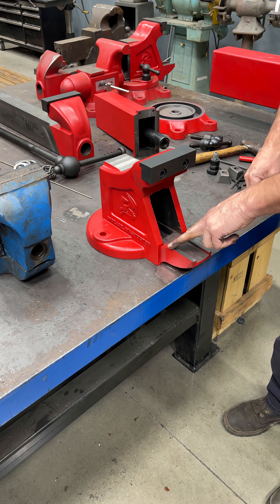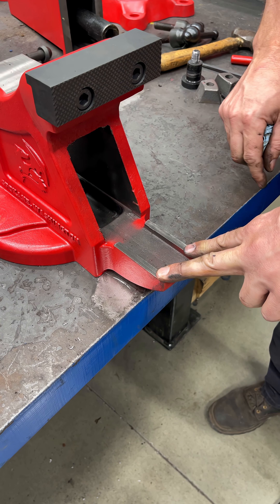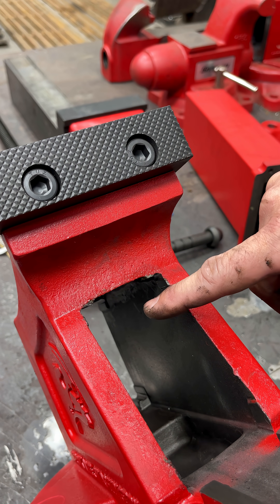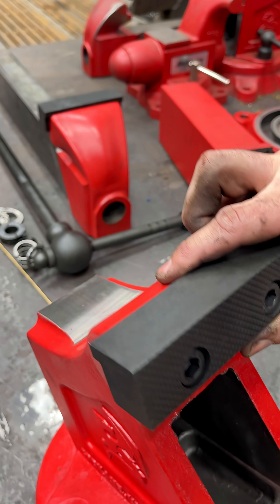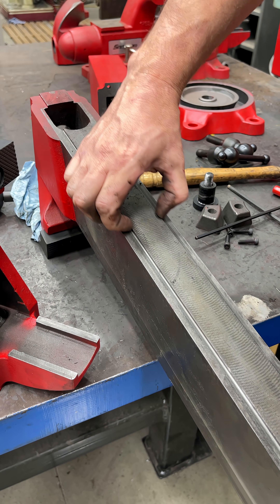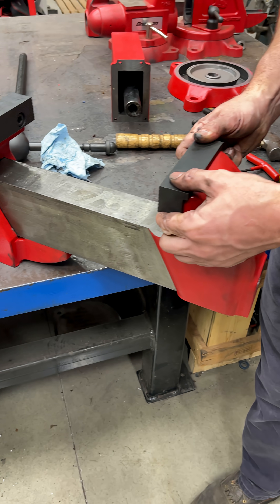So let's look at the Fireball vise. We have a long chin — this gets supported way out here several inches. It has pads on the bottom, machined pads on the top, on the sides, and on the back. There's a groove in here that matches this groove right here in the bottom. See how tight it is? There's zero roll in this.